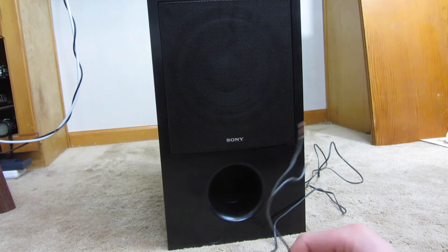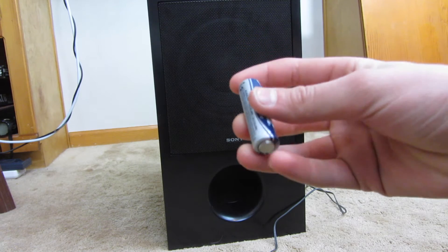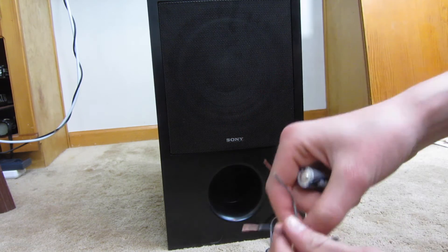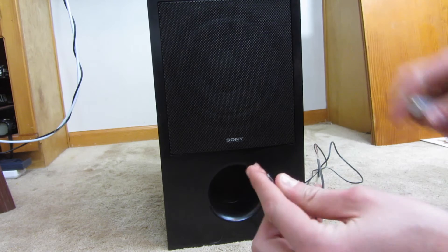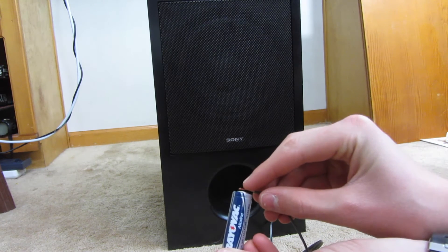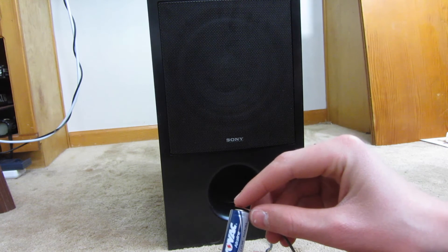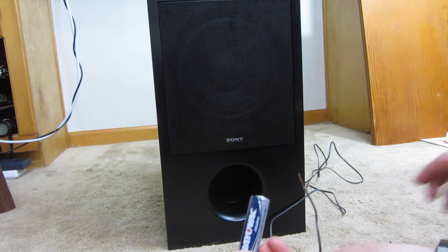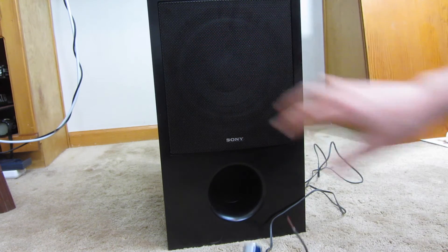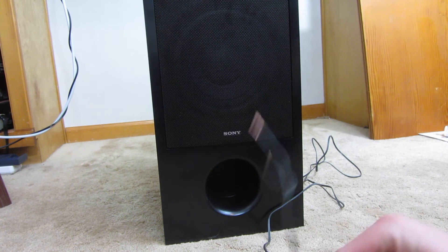What you're going to need is the speaker with the wires going into it, and also just a AA battery — a C or D battery will work too. You need to be able to see the actual speaker inside. Connect one wire to the positive and one to the negative. When I do that, the speaker is coming out, and when I flip it around, the speaker is pulling in. When it's coming out, that's correct, so the positive wire on the battery side is the correct one.